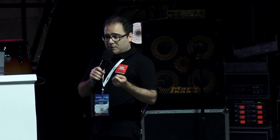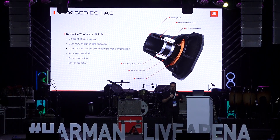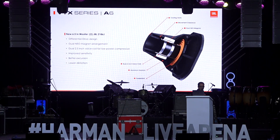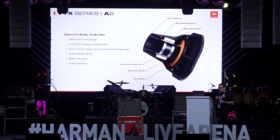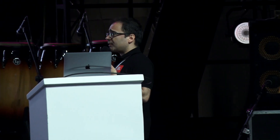For the A6, the main thing was the woofer. It's a compact system, and what makes a compact system loud and gives us high pressure are the woofers. So we designed a new custom six-and-a-half-inch woofer, which is very powerful, to keep up with the highs and give such a compact system the output levels required. This new woofer uses two voice coils — usually woofers use one voice coil internally. Having two voice coils gives us twice the power of traditional woofers, much better heat dissipation, and much better output. So: custom HF driver the same as the A12 and the A8, and a brand new custom woofer to support that HF at high output levels.